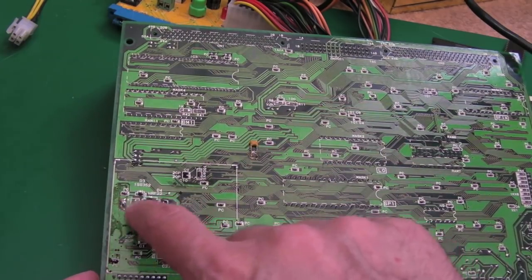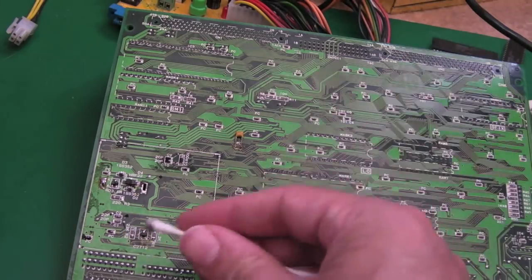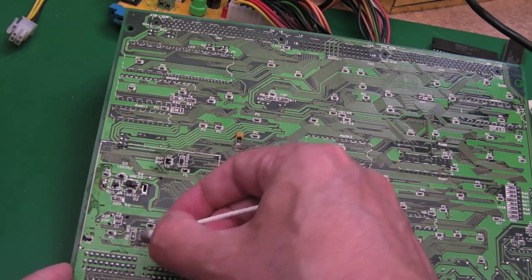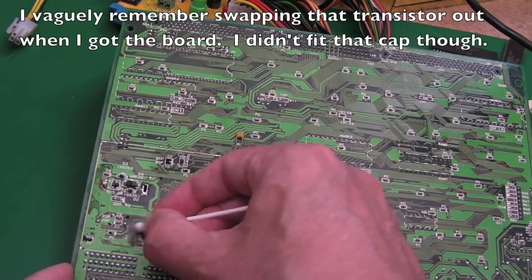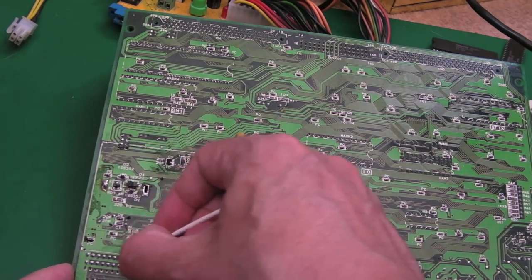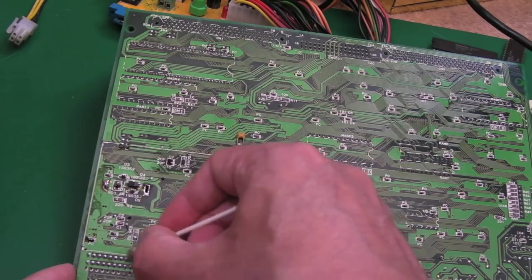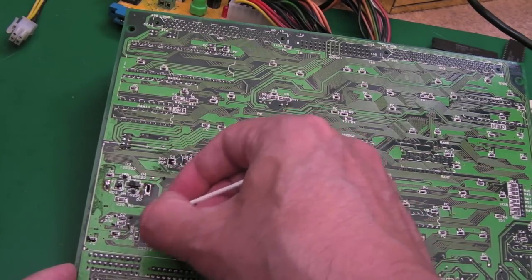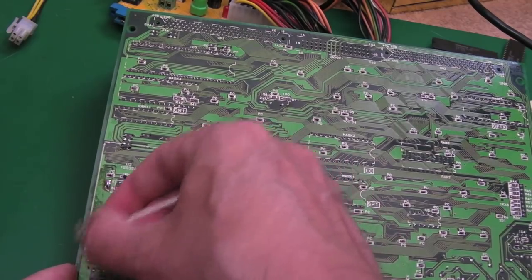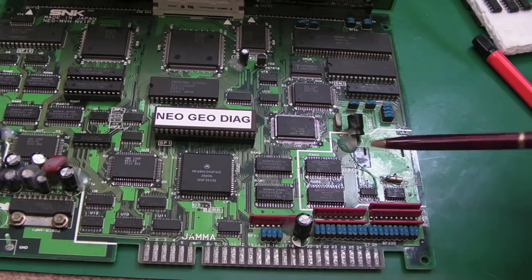I've done some comparisons measuring the circuit — some diodes in the battery charge circuit, and in particular that transistor used for the BRAM. It measures exactly the same as the other one, and there's a bit of flux on it suggesting someone's swapped it out to try to resolve the problem. The fact it measures identically in all three pins in all directions makes me think the transistor has nothing to do with it. What does that leave? Still the 74HC04 — even though it's outputting a high when there's a low, we don't know if it's constantly outputting high. The other thing is with a normal BIOS you'd expect a backup RAM error, not garbage and a watchdog — that suggests something else is going on, possibly a second fault.